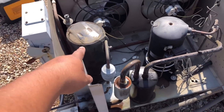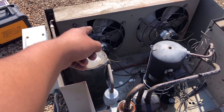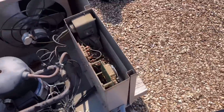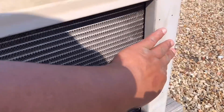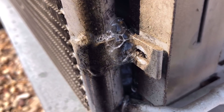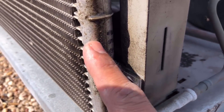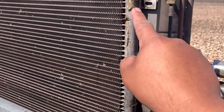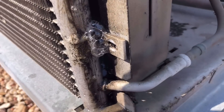We're going to recover everything that's left in the condenser, open it up to atmosphere, and then start working on the condenser. But first we're going to have to actually pinpoint the leak. I know there's a leak somewhere in here and a leak in here, so we're going to go ahead and disassemble this. Looks like we got one right where this bracket welds into the side header — let's just call it the condenser tube.